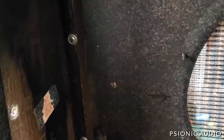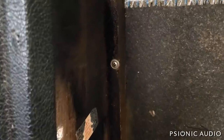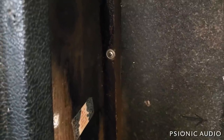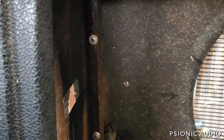The store did not have the right length of number 10 screws — they go one and a half and then jump to two. I didn't feel like delaying the whole thing to order specialty screws. I reached out to some other amp techs and guys who do woodwork, and many said that for a simple repair like this, just stuffing the oversized hole with Titebond and toothpicks ought to do just fine. So I've done just that on all four screws — this one took five toothpicks, this one took four, the other two just took three. It's all set up now and seems rock solid, so the cab will not be vibrating. That's crucial.